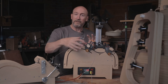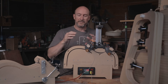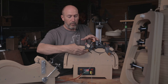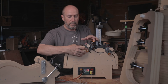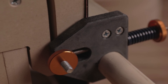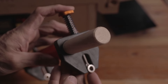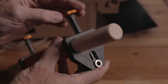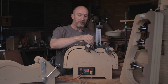Let's take a look at the roller assembly. While it may look familiar in form factor, it's a complete redesign from the ground up, looking at all the improvements we could make while still having it function in the way a lot of people really like. The first thing I'd point out is the tension assembly — this is where you see the most stress in the roller. We replaced what were a bunch of plastic parts with a steel tube welded to a threaded rod, so that assembly can take an immense amount of pressure over time without deformation or fatigue. We also added a knurled thumb wheel at the top so you no longer need a hex key or any tool outside of the machine itself.